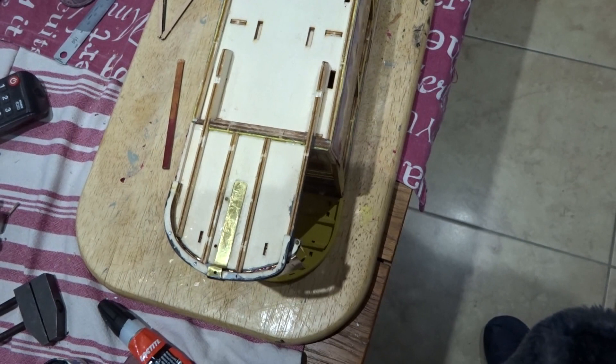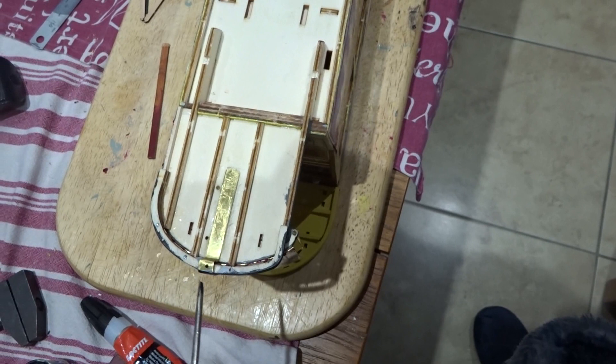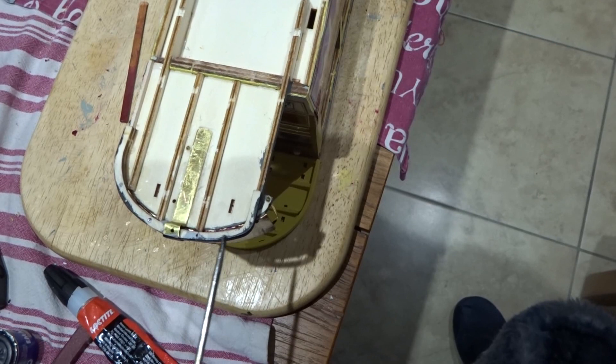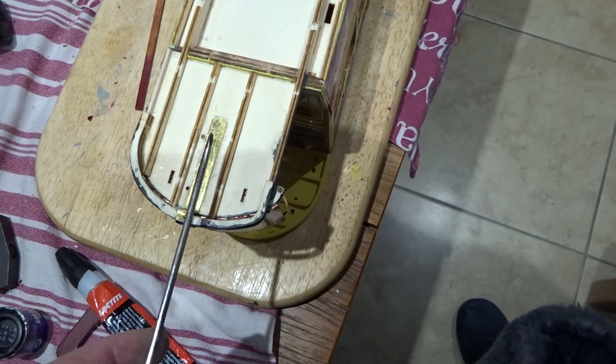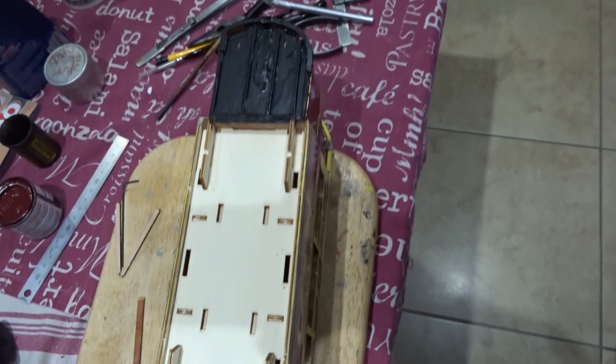To make the tram more suitable for towing in an outside situation, I've also fitted and glued brass reinforcing strips along the bottom of the tram and around the supplied bumper woodwork. These bumpers are quite flimsy — clearly this model as designed is not intended to be working. So that's why I've reinforced all this, and the draw pin will now come through the brass strap that I've made for each end.